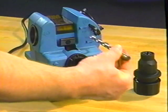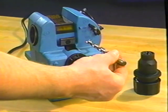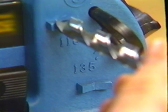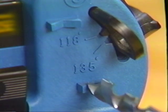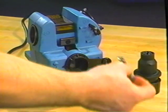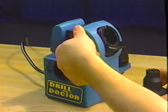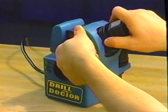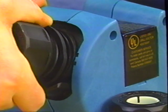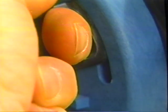The first step is identifying your drill point angle and setting the machine. It's a good idea to start with a drill of a quarter inch to three-eighths inch in diameter. Hold the drill against the angle notches to determine the point angle of your drill. To set the angle indicator the same as the drill point, insert a chuck without a drill in it into the sharpening tube labeled number three. Use the chuck as a lever — pull out on the loop handle and move it to the appropriate location. Make sure the notches in front and back are seated.